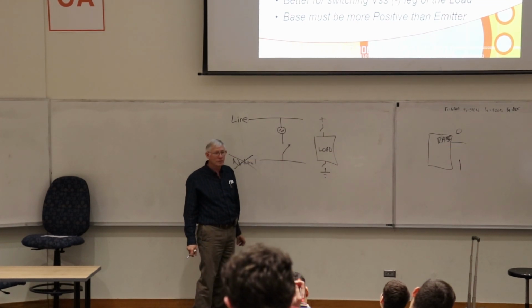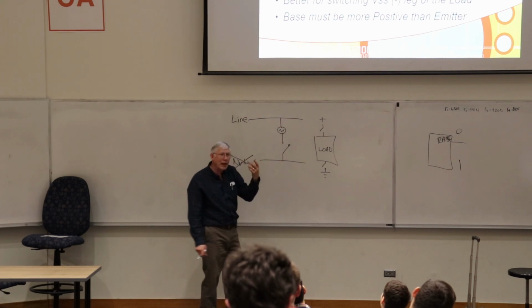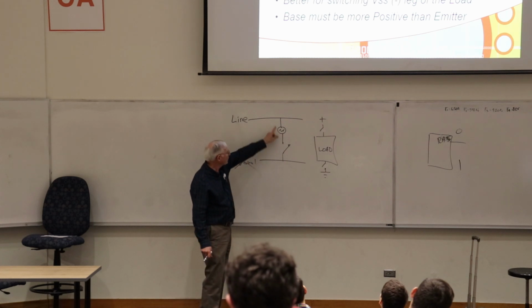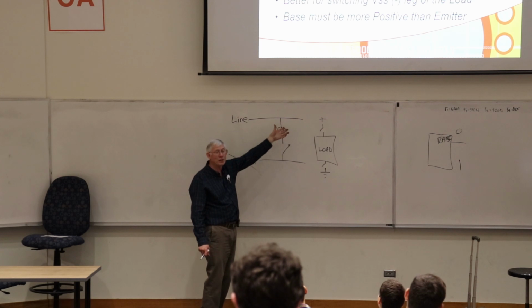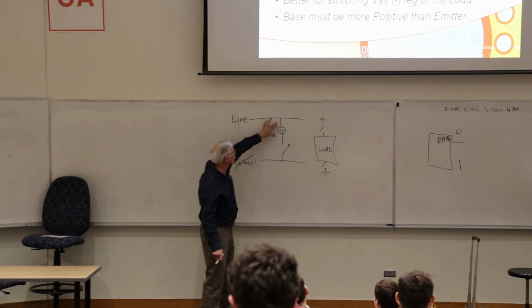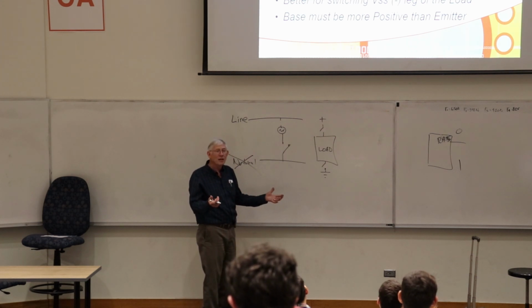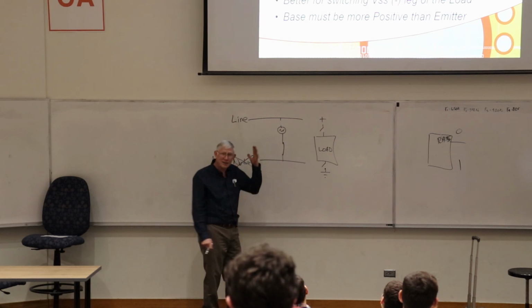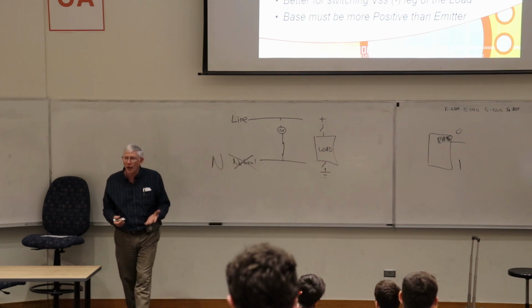Now, let's say you're changing the light bulb. You turn off the light, and then you get up on the ladder and you're unscrewing it, and you're not being super careful, and your hands get on the base threads of that bulb. It's hot. You're in trouble. You're probably going to feel a nice little zap and fall off the ladder and break your neck. So you would really want to switch it up here, wouldn't you? Right? Because now the device is grounded, but it ain't hot. And that's why we normally want to switch the high side.